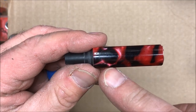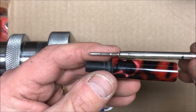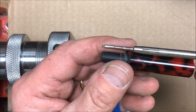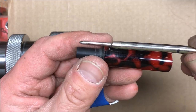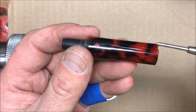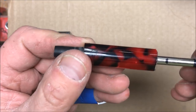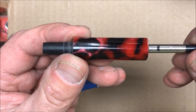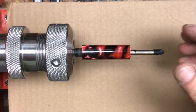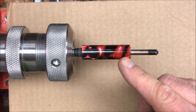I've got my section and I need to drill a 15/64-inch hole into the acrylic piece I glued into the front. I laid an ink refill next to it — you can see where the tip of the nib lines up with the tip of the acrylic, and I put a black mark on the ink refill showing how deep I want to drill. Seating the ink refill, I'm about 3/8 of an inch shy of where I need to be, so we'll drill that distance. I'm really happy with the result — I drilled to exactly the depth of the black mark on my refill.